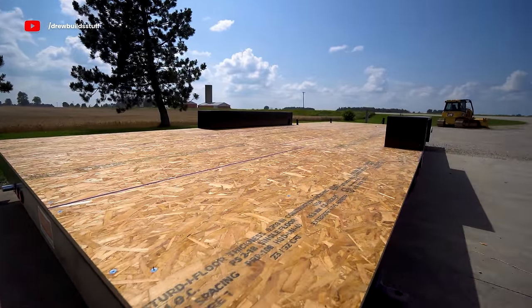With one coat applied, the stuff needs at least two, so the next day I came back and sanded it with a 220 grit sanding block, and then applied the second coat. This is also the same stuff I used to seal up all the cedar soffit quite a while ago. With that done, I can start finishing up the siding and doing all the other finishing touches.